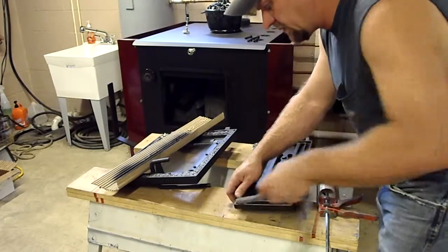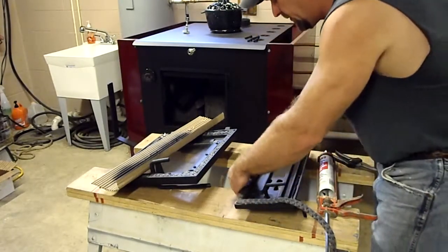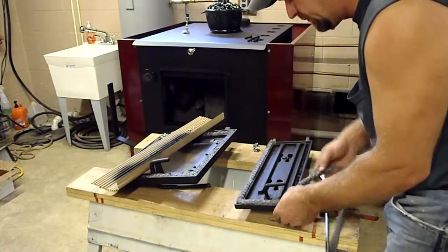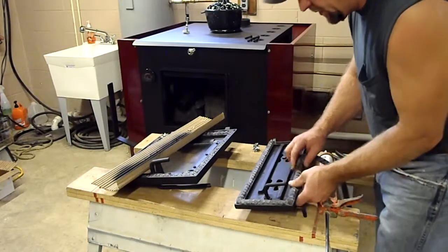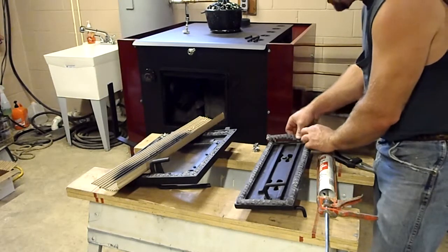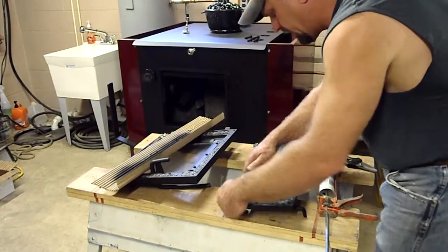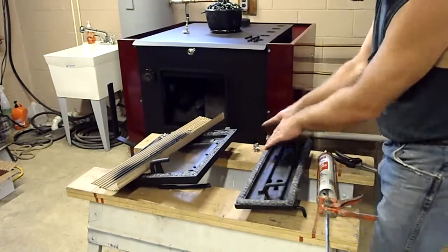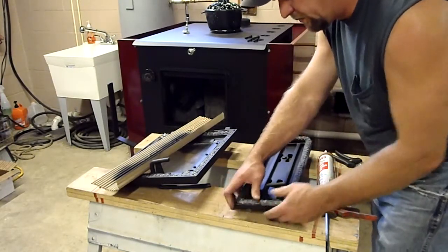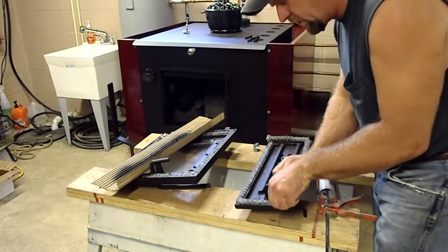And if everything was done right, and I put it back the way I tested it, it should fit right into the same starting point down here. That's what I'm trying to get at. Just double check it, make sure it's bunched up where I want it. Remember, work your way back to your starting point if you want to add more gasket to thicken it up or widen it up a little bit. Don't pull your corner back out, in other words.